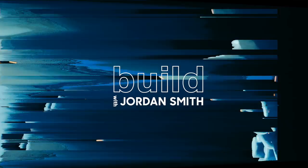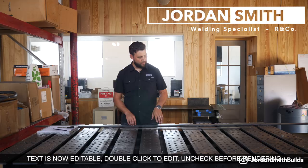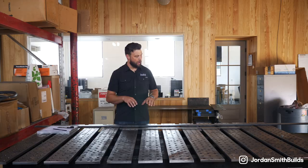Alright, we're here back at the shop, and we're going to be taking measurements and showing you how to get a few angles off of drawings, and we'll be fitting up this first rail. Before we get into that, I want to talk a little bit about the two different types of materials that we use mainly for rails. We do it mostly out of steel, and the two types are cold rolled and hot rolled — A36 steel.